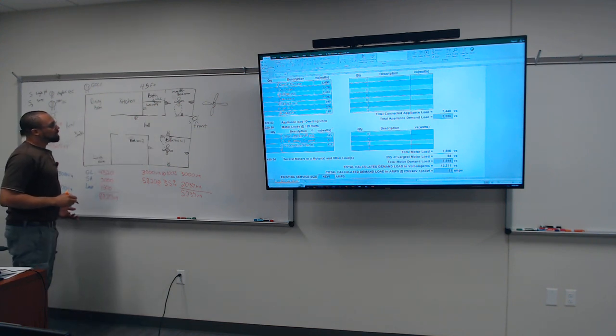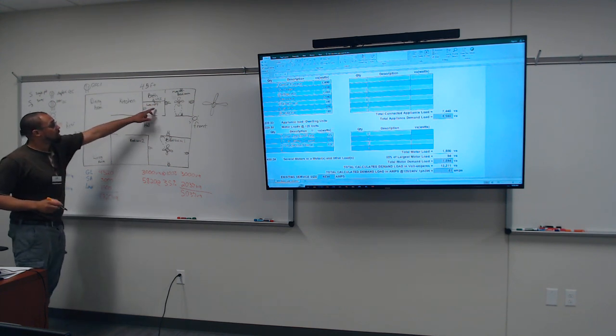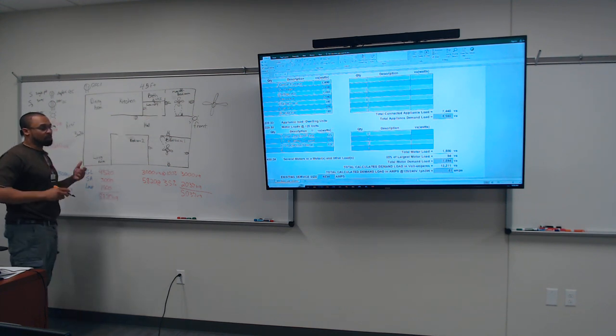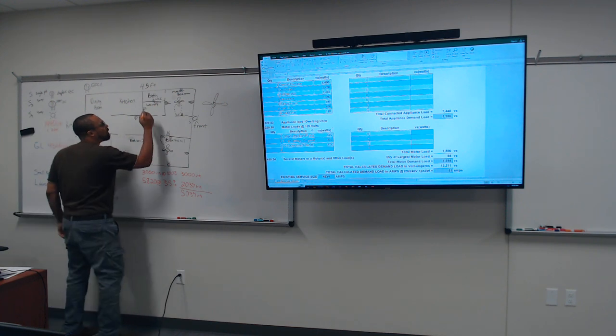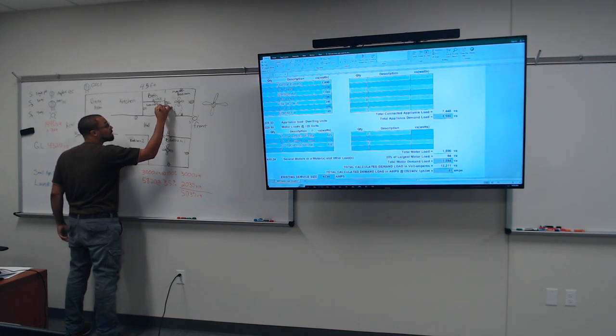And then, hey, you know what? Let's throw in another plug inside of the laundry. Normally you have about three plugs in the laundry for your washing machine and ironing clothes or whatever you're doing in there, right? So I put the dryer plug right here. I'm gonna put another plug right here and label it as GFCI. And put a light.